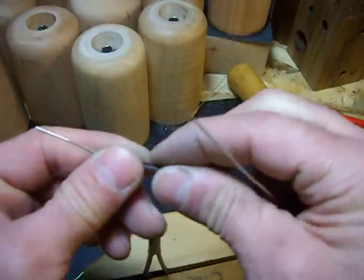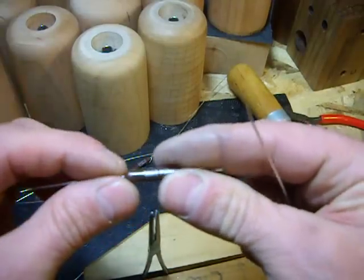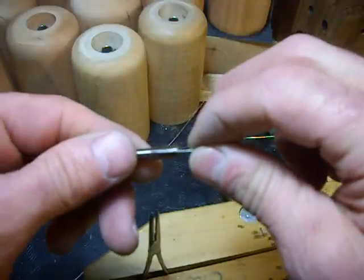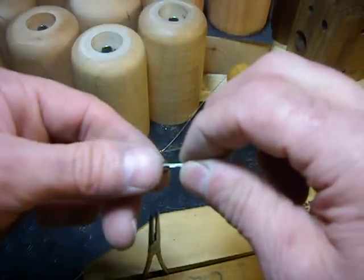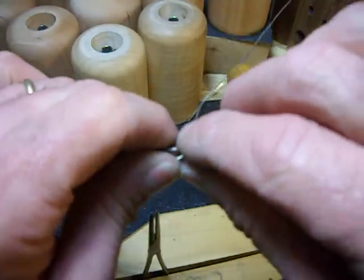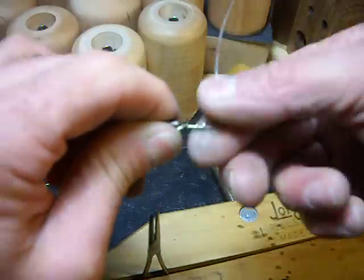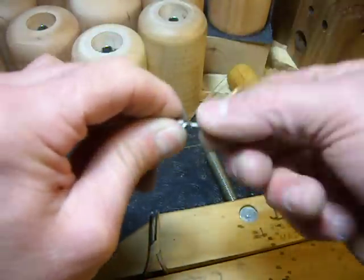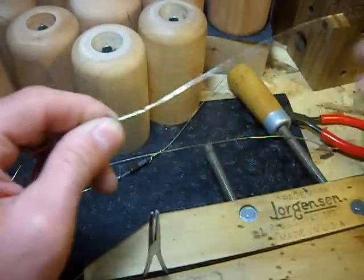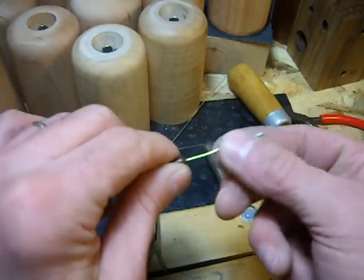There's a long side and a short side to this resistor. Straighten your wires out so they're going away. We're going to start with the short side. Overlap this wire and hold it against the resistor. I'm going to wrap this like a barber pole. Pinch it firmly and pull out like that — snugs up and cinches the wire.